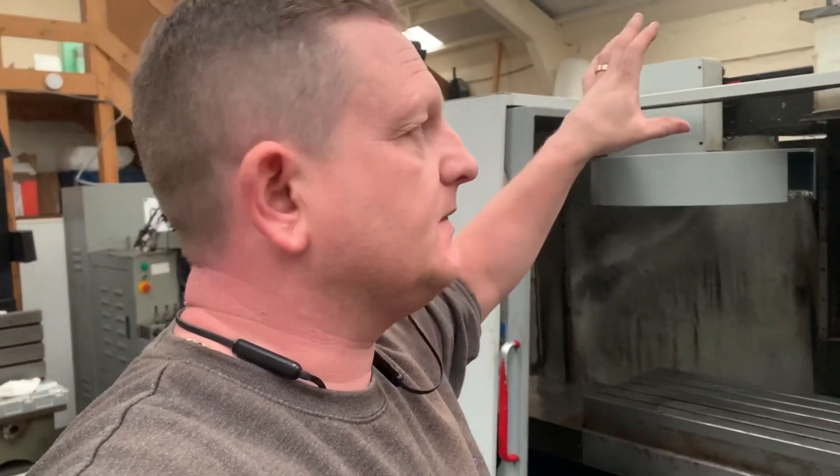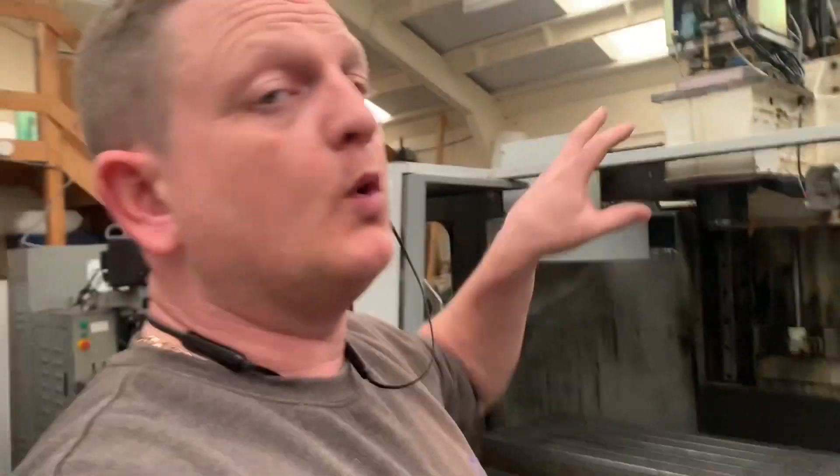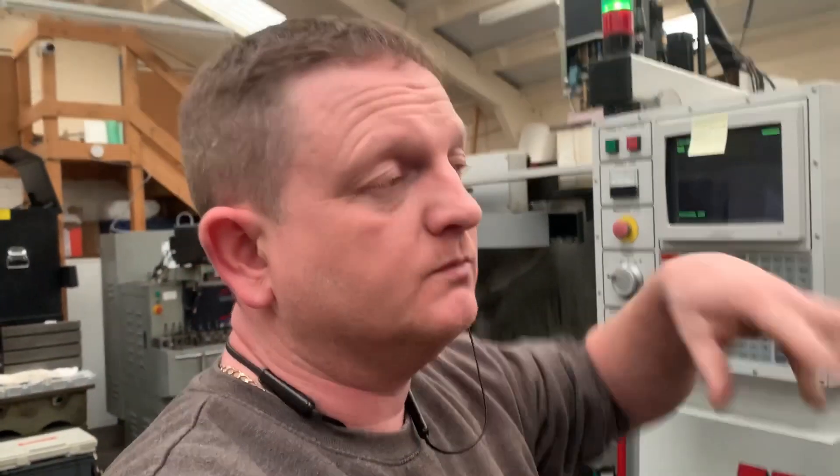I've had a little mess around and it seems to have got slightly better. If you manage to change gear in the morning on the power-up restart and it works, it will work all day. I'd read about burred-over gears — sometimes running the machine in reverse and doing cycles will help push the burr back the other way. So I ran it for a day or two in reverse, counterclockwise, doing various gear changes. But come in the next day, power-up restart won't change gear. Disconnect the airlines, blow air into it — changes gear, no problem.